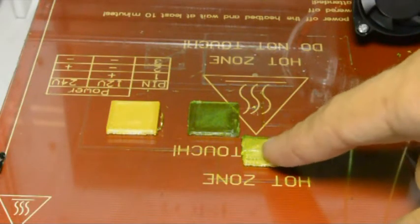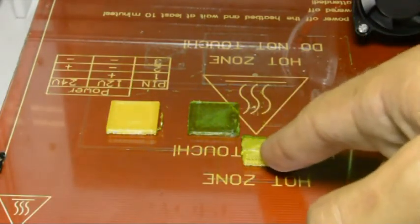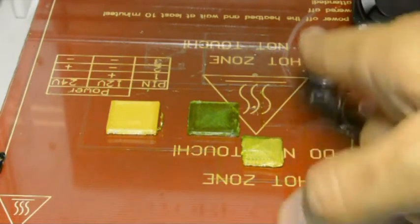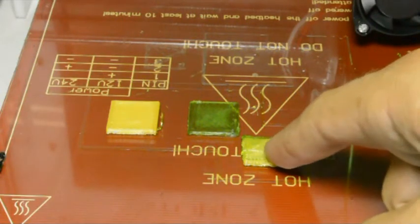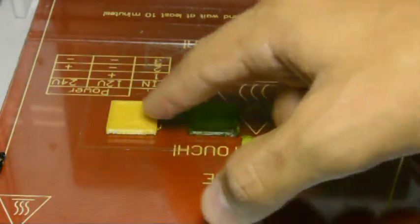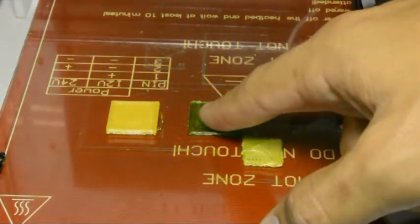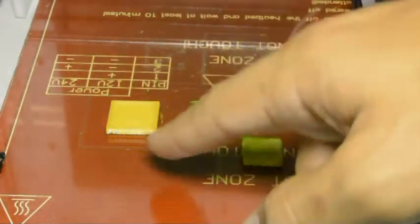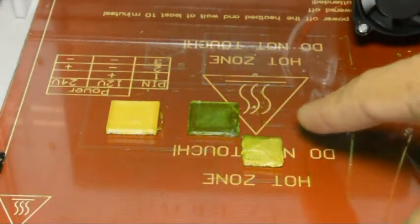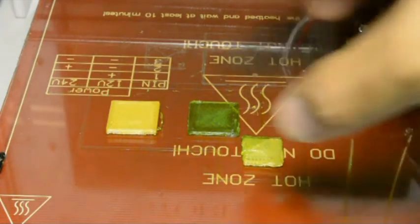This is the next print, stopped a little way in. The green has shifted in that direction and the alignment looks quite good. However, the shift in the Y direction seems to be in the wrong direction — we should make that minus 1 instead of positive 1. The green is still a bit lower than the gold, so we need to lift the left extruder a little more or drop the right one. The total print height is also still a bit low, so we can reduce the distance between the bed leveling probe and the nozzles a bit more.